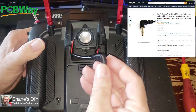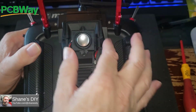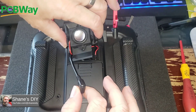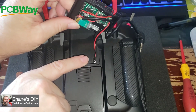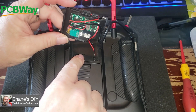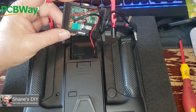This just plugs into the headphone jack — it's a right-angle 3.5mm stereo jack. But the little module bay still pops off normally. Everything's attached to the module bay. I'm just tapping in power off the module bay port. Two of these wires are for power, but you do have to activate the module bay, so you'll be turning on your external RF module in each model separately to do this.